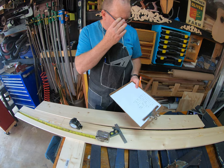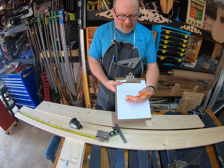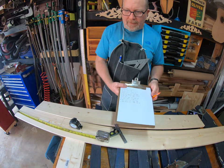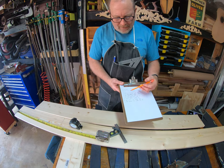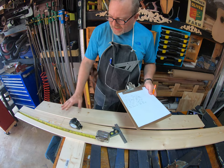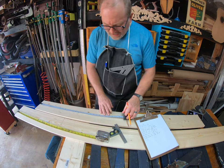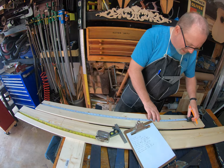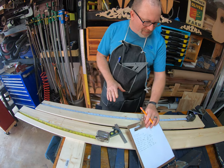Here's a good tip when doing a wood layout for a furniture project: make yourself a list of all the parts you need, with each part listed and its dimensions. A lot of folks new to woodworking will take their tape measure, say the first piece is 24 inches, then go to 48 for two pieces — but if you do that, you're going to make a big mistake. Here's why: you haven't taken into account the width of your saw blade, which might be a sixteenth of an inch up to three-eighths of an inch.